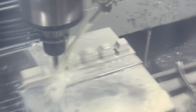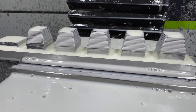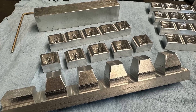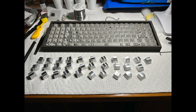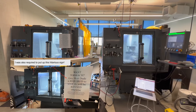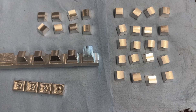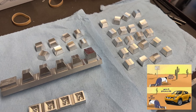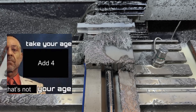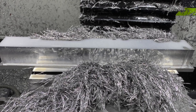I then amped it up and made the first key in aluminum, and satisfied with the process, I started making five at a time. After successfully reconvincing the staff of my sanity, I started using a Tormach 1100MX to make keys faster, as the spindle can achieve double the RPMs, which means I can remove material faster and bring down cycle times. The 1100MX also used BT30 tool holders, meaning I did not have to manually do tool offsets anymore. Testing and optimization brought total cycle time for five one-unit keys from 6 hours to under 2.5 hours.